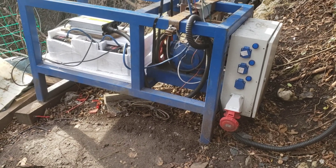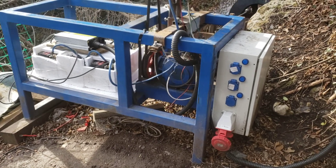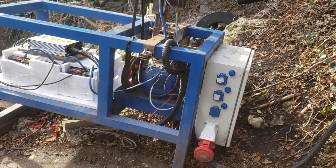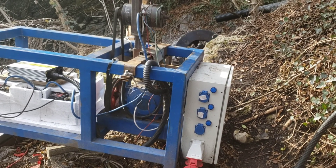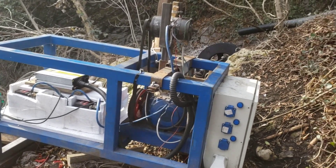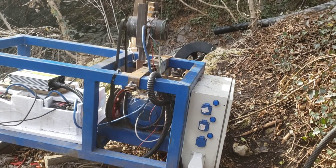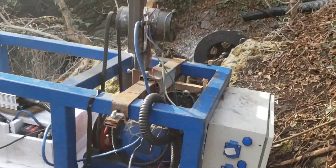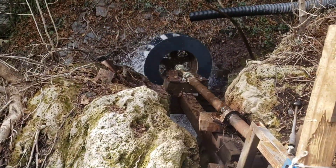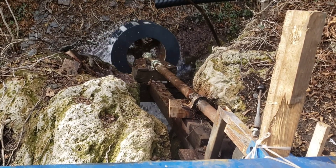It doesn't look like it's spinning fast, right? Right now we are at about 1,300 RPMs. The problem with the alternator is that magnetic braking effect — whatever that kicks in, it slows down the system so much. So the wheel has to be much bigger with more propellers so we don't lose any momentum. Without the dynamo and alternator, my system runs at about 3,500 RPMs. We have enough water — we just don't have enough propellers and the wheel is not big enough. That's my biggest conclusion.